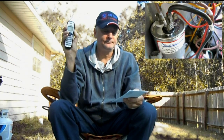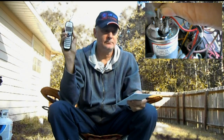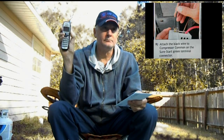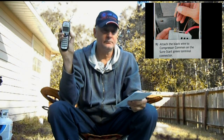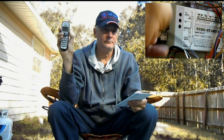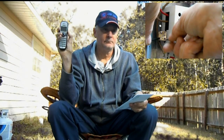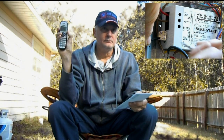When you go to a soft starter, it uses a minimal amount of amperage to kick over the compressor. If you had a unit standing side by side on the floor, you could start it direct on line and see what a jerk it makes to the compressor. But if you put the soft start in front of that and turn it on, you see a very soft motion — not even a jerking — as far as kicking over the compressor. It's a completely different concept: one is full speed and full amperage, while the other uses minimal amperage to get from a standing stop to operating speed.